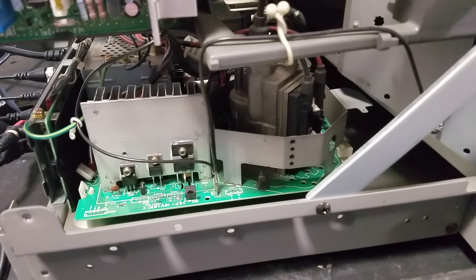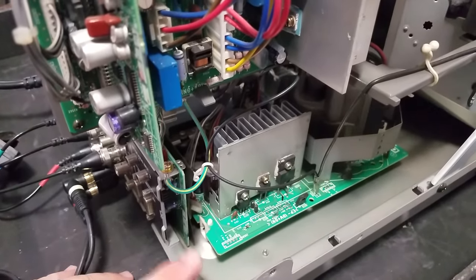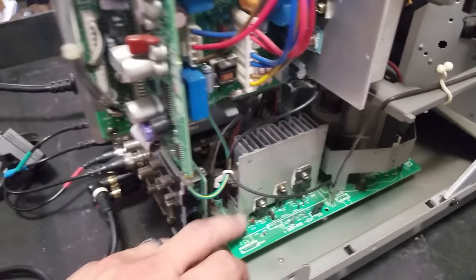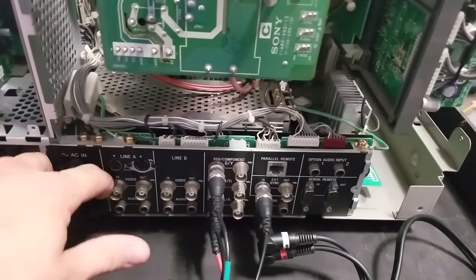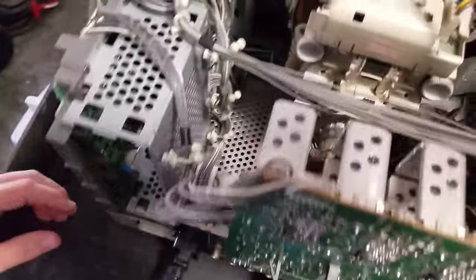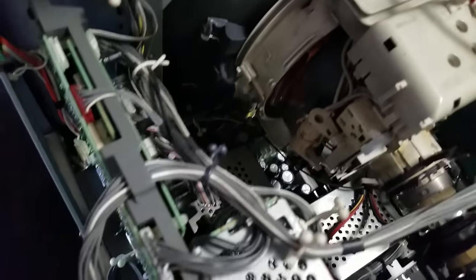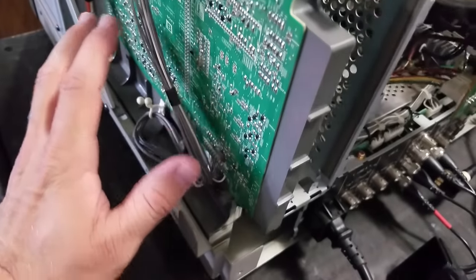This monitor is very tightly put together. There are no issues I can identify that can't be changed from the sub menu, but we will still want to change out the capacitors at least on the deflection board — which will mean a full teardown. Going around back, the video inputs are standard for this monitor, just like the 20L2: RGB, component, and mono audio. It's hard to see, but that shiny area down under the yoke below the deflection board is actually the mono speaker — it's not on the front or sides, but all the way down at the base.